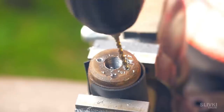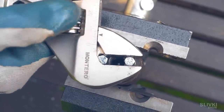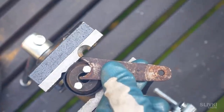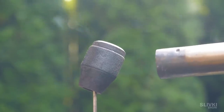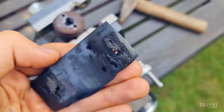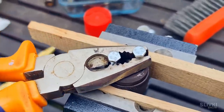After marking two points on the bottom of the chuck, we drilled two holes there. We put two bolts in them and tried to unscrew it with a wrench. We were sure it would work, but it wouldn't no matter what we tried. We decided to heat it up with a gas torch to see if the heat fluctuations would help the threads move. We also put it in a small cap and poured some penetrating oil on it, but that didn't work either. Then I figured out how to clamp it between two oak planks — and a miracle happened. It worked and the thread moved!